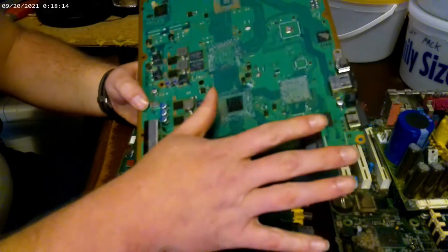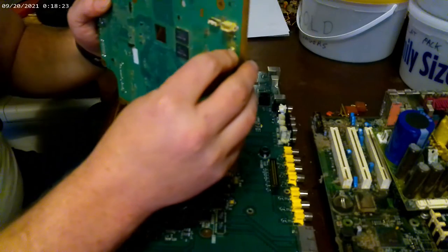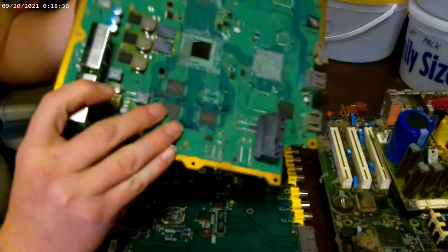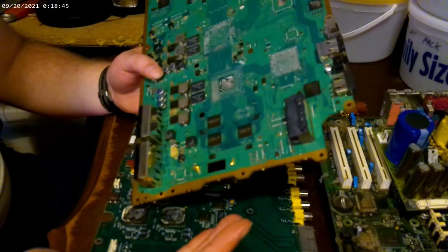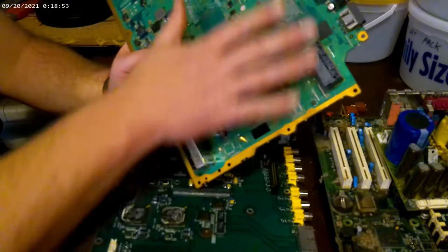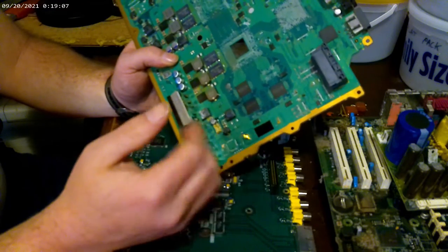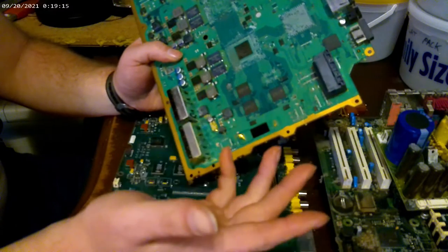Something like this, I'm going to strip everything off of it on both sides. You're looking at gold pins, gold pins, gold pins — because these are the ribbons that go in here and they clamp down on them. Not all of them are gold; some of them are silver. The gold, you can see easily. Once I strip everything off, there's a compound I can soak this board in and it'll take all the green off of it, leaving that gold coating. Then I can soak it in another compound and it'll peel the gold off the board for me to refine and use for pouring or just save.